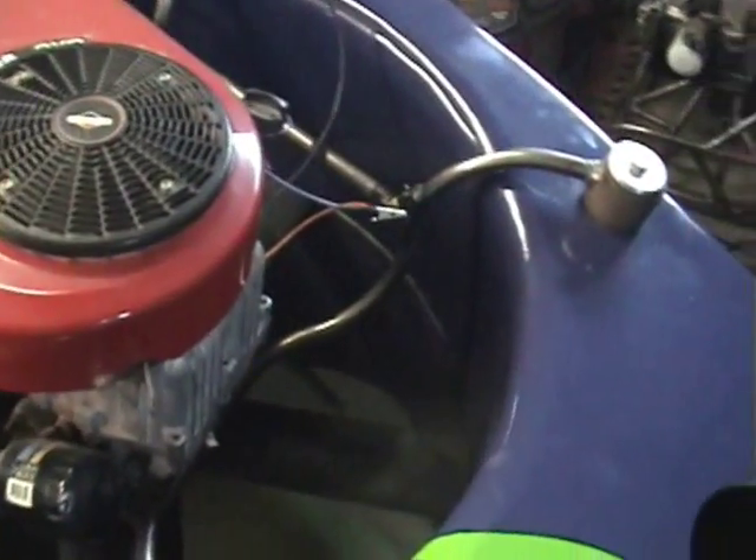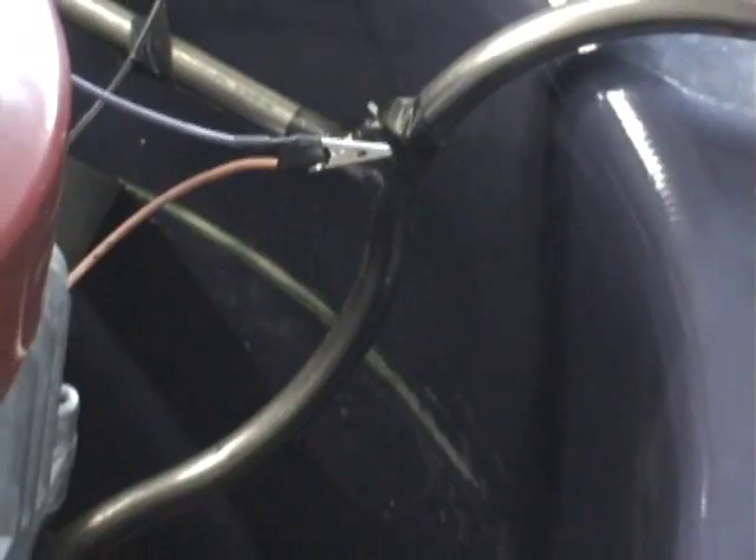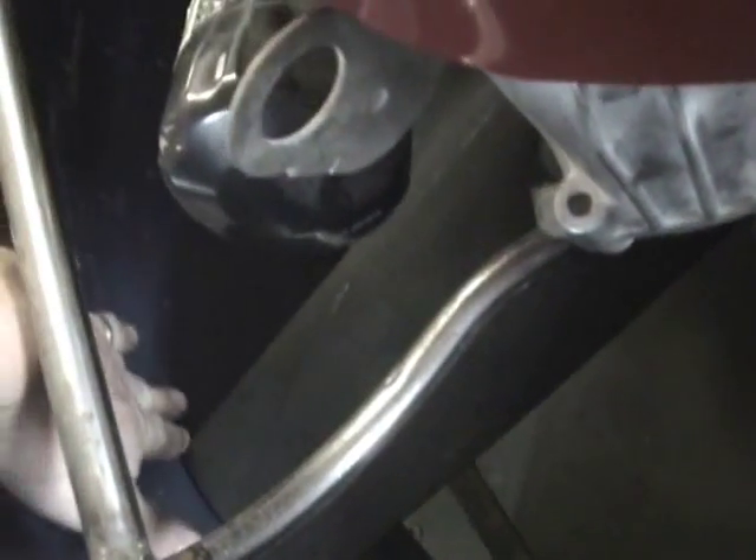As you can see down there, I had a little spot where it was rubbing, and there's an almost identical spot on the other side — not quite as bad, but pretty hard to see. What I did was take some sandpaper, sprayed it with spray adhesive, and put it on the side of the wall right here and also on the other side, and just shaved just enough off of the tips so I shouldn't have too much of a problem with blade strikes. There's maybe an eighth of an inch clearance there. The duct opens up a little bit in the back — it's a little oblong.